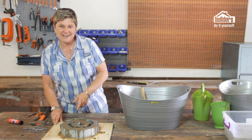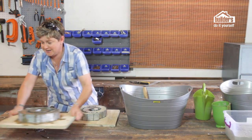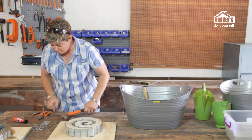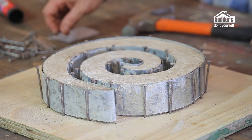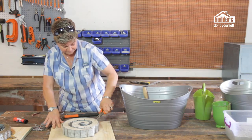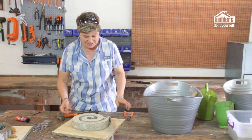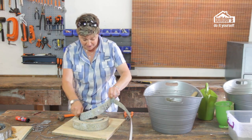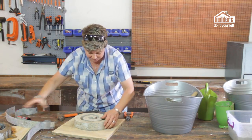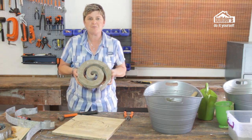Let's show you one that we made a bit earlier. All we need to do is start removing the nails — because we didn't lock them in all that deep, you simply take the pair of pliers, wiggle them a bit, and out they come. As you do that, the galvanizing strips simply just slip off and can all be used again. And here we have one awesome spiral paver — smooth side looking gorgeous. All it needs now is a good spot in the garden.